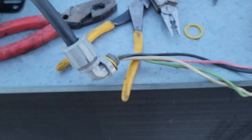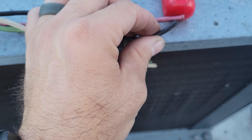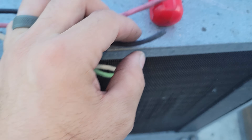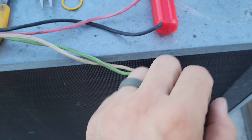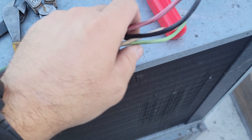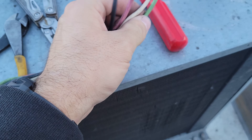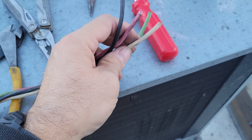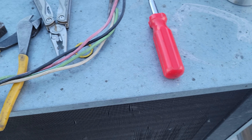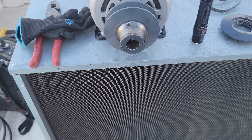You don't want to go too far, because in order to cut the jacket you really have to get down and it will oftentimes nick the wire. Right here — it's hard to see, but that wire is nicked. I only do it for a small section, then I pull the rest off with my hand. I make it long enough so I can cut that nicked section off, because we don't want to leave a nicked wire, especially at higher voltage where you'll have voltage jumping and shorting out.